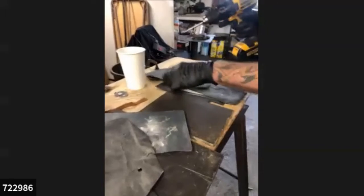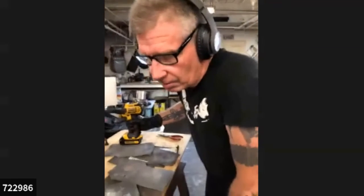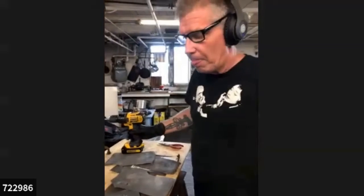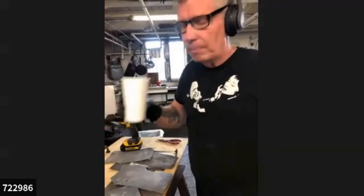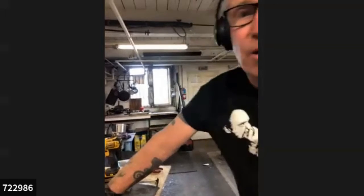So I start with, go ahead. On the sandpaper, people have asked what grit belts do you use, and work your way down to the sandpaper. Very good questions. That first one was roughing it down, and I believe it's a 36 grit. Let me have a quick look. Stay here, Kim.